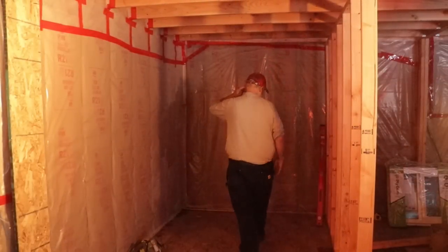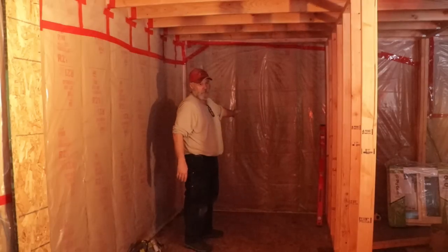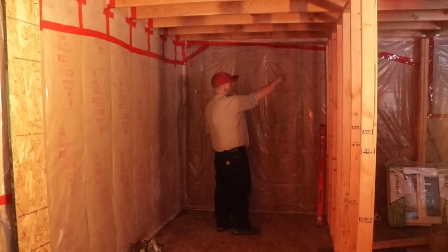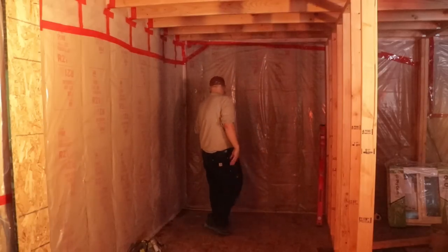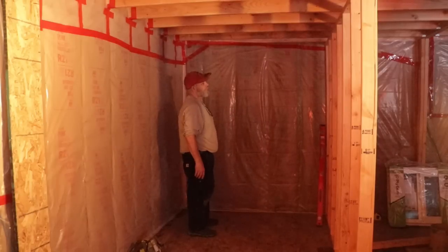Pretty sturdy, right on. And that gives some added support to the loft as well. The reason why I wanted it 6 feet wide is because then I could put a bathroom or a shower or tub in the back here. And I'll probably scooch it against this wall, because if I've got water in here before I have a well, I'll store it in the pantry with a pump and an on-demand water heater in there. And then I'll run PEX lines from that to the shower, probably to sink here in the bathroom.